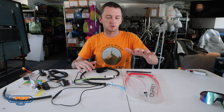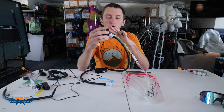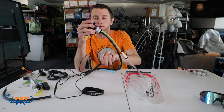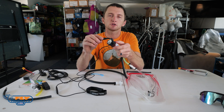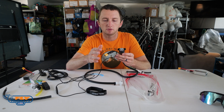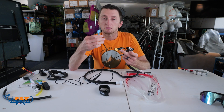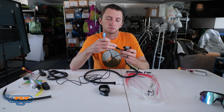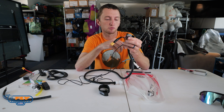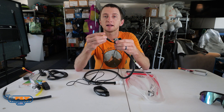Now we have our smoke system, and the bite switch would be fed up through here. If you don't want to use it, you just put it away. So the actual smoke system uses this line here run to the motor — the black tube is the outlet. This goes to the bottom of the bag. For most people, the harder part is wiring. You can solder it, twist them together, use wire nuts — whatever works. You basically put the switch in between either the ground or positive and run that right to the motor, creating a bridge where the switch lets power flow from the battery to the motor.